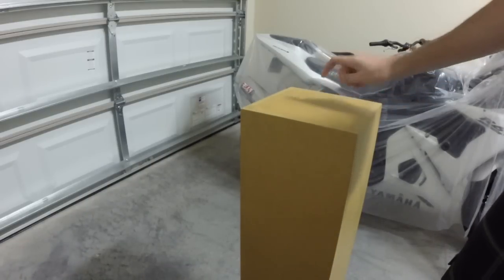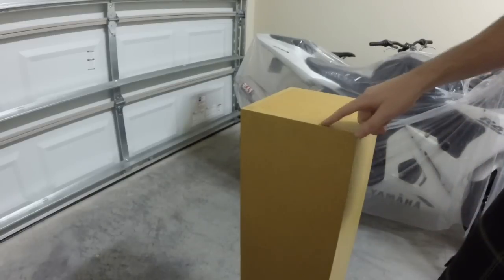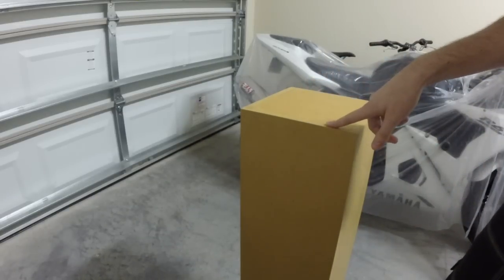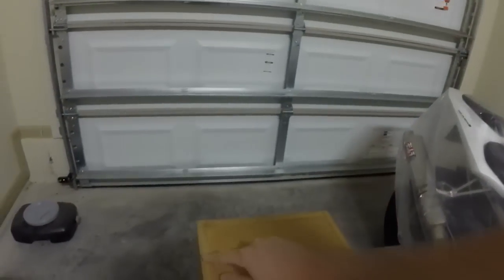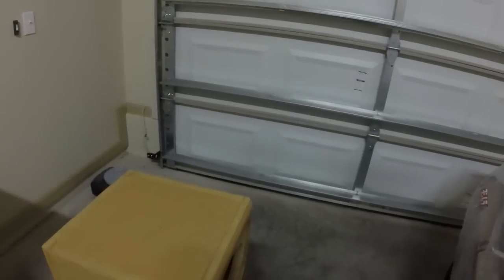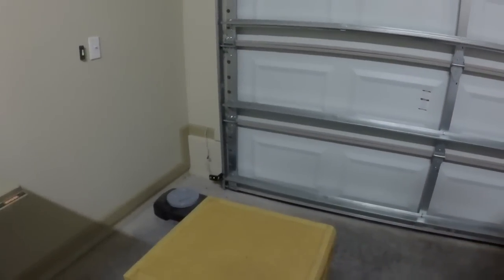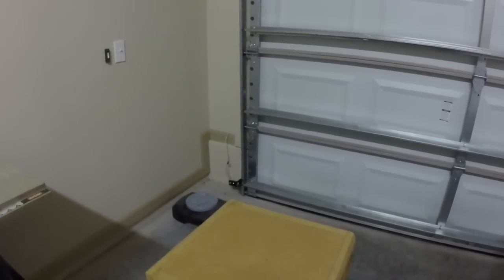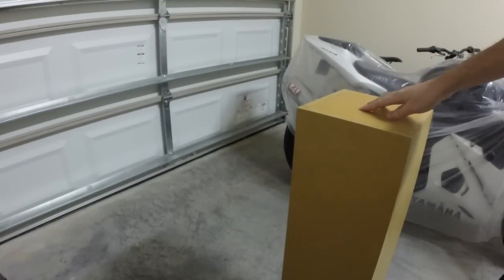So you can prime the top of MDF, and it'll be fine. It's these side cuts that would really get you. So where the wood is cut up here and where it's routed along here, that's where you really need to do the wood sealant. Now, yeah, you can just paint these edges where it's routed and the side of the MDF, but if you do that, you're going to want to use a high solids primer to really fill in the grain where you didn't paint the wood filler on.